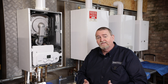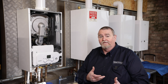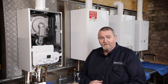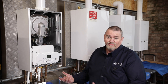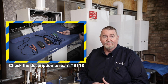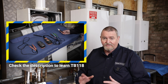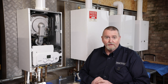This is something you would do on a routine service if it needed to be stripped out and cleaned. We'll show you how to check the seal. I've already got the front removed off the boiler and the boiler isolated. We've worked on this boiler in a few other videos — it's just two screws to remove. We've carried out safe isolation as per our safe isolation video, TB118, your gas safe technical bulletin. It's always about working safely and making sure that we all go home in the evening.